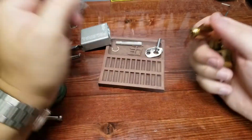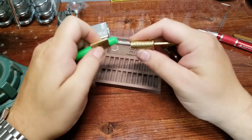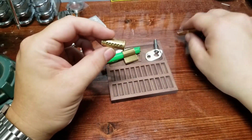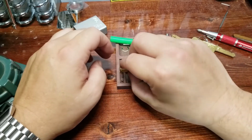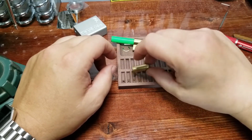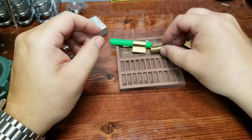Take one of these keys and let's get a follower out. And it is a 6-pinner, so unlike the American locks, this one is pinned with 6. So let's take this one apart. 1 is an anti-drill pin, 2 is a serrated, 3 is a standard, 4 is a serrated, 5 serrated, and 6 is a standard. And nothing magic on the core, just nice and smooth.